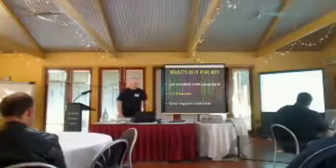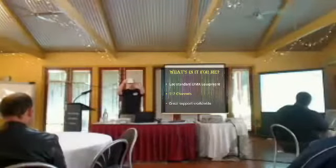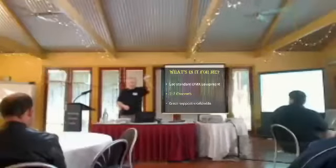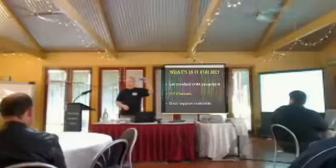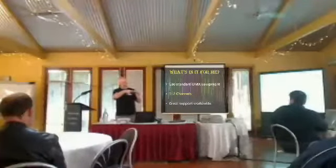In terms of hardware, as I said, there's DMX dongles. This is devised by J1Sys, which takes E131 one side, which we'll cover shortly, and DMX out the other side. All universes come out there, one universe on each of these.